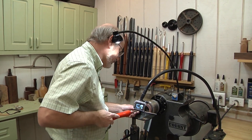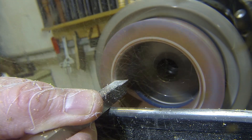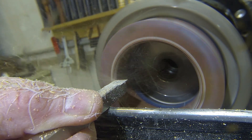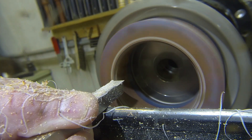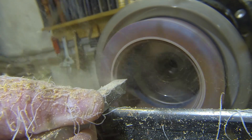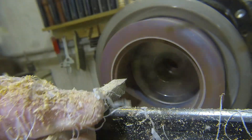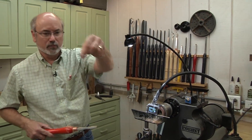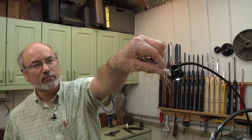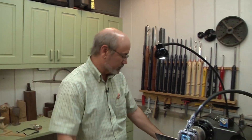We're going to just come in here and gently make our cut, just push in a bit. Some neat shavings come off of here. I can tell you right now this is resin impregnated - I think he actually used some clear resin to help solidify the wood, because I can tell by these little wispy shavings that are coming off. They look like plastic a bit. That means this will hold up really well and won't absorb a lot of moisture, so this will last a long time.